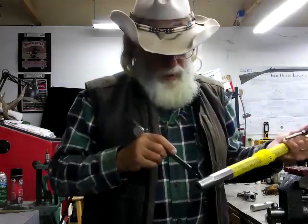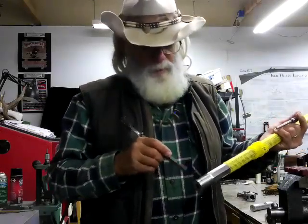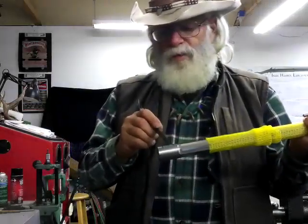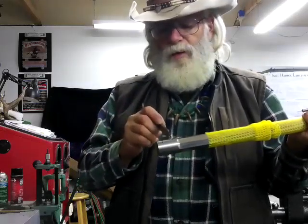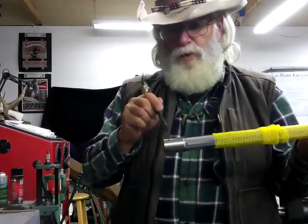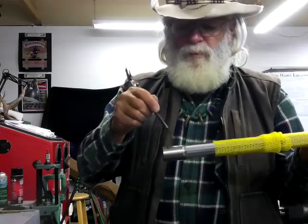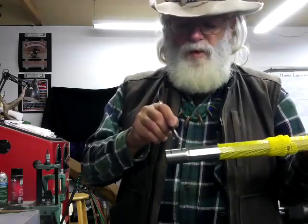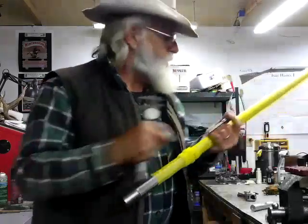So the first thing I'll do when I put this in the lathe is face it off or cut it off — it's not very much distance, probably just as fast either way. I'll cut that off, then turn it down to the diameter I want the stub to be. Then I'll face it off and get it approximate, and then we'll start the threading. After it's threaded and it screws down, and the receiver face hits this shoulder, we'll continue to take small amounts of metal off until everything lines up the way we want it. That's kind of how I do that.